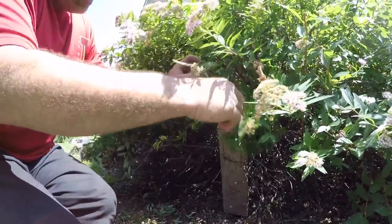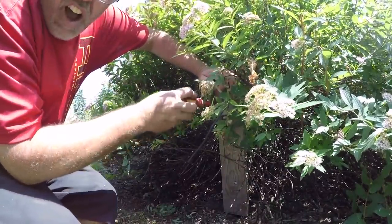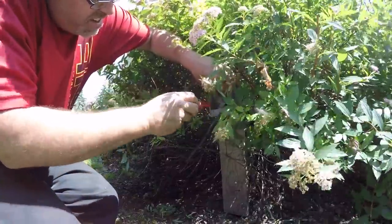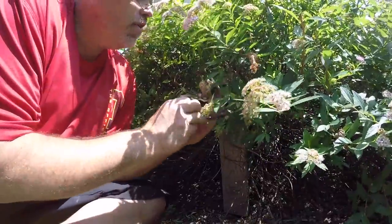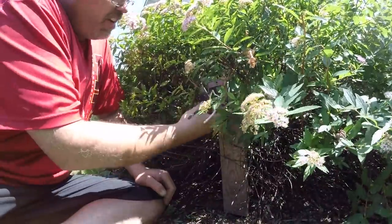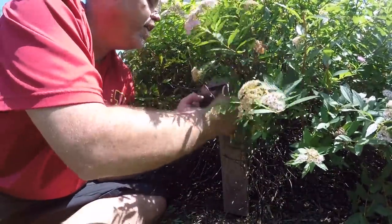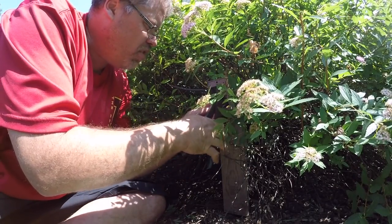And now, being outside, we want to make sure we ground the old box. So we'll put it through the screw in the box, and hopefully you can see, boys, but it's pretty hard where I am. Here it is. Hey, I'm in a bush, for frig's sakes. Normally you can use bigger boxes so you have more room, but hey, this is BillSiff we're talking about here.